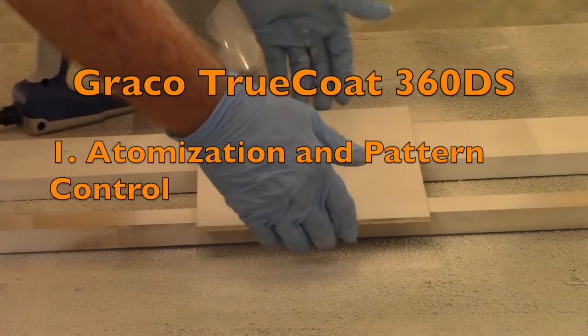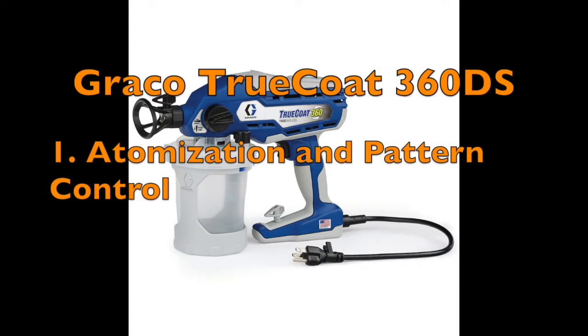Let's review what we learned from putting this model through its paces. Atomization and pattern quality. Overall, we were very pleased with this little sprayer's performance in this regard. We knew going into the test that it was unlikely that any handheld unit could match the power and fine atomization of a full-size production sprayer, but with maximum pump pressure of 1500 psi, the 360DS produced a very good finish of uniform thickness with no runs or sags, even on a vertical test piece. The key is to move fast enough to keep up with the volume of material produced by the pump, but not so fast that a chattering or pulsating pattern results.